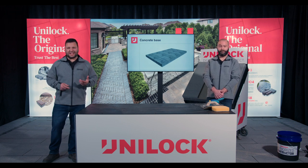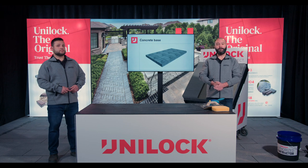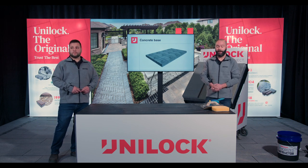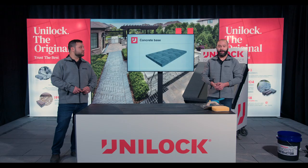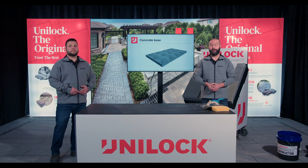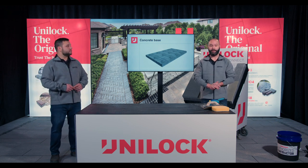If we're installing wet set on a concrete base, does that mean we need to pour a new pad, or can we work with what's already existing? Not necessarily — as long as the slab is structurally sound and not subject to frost heaving or any other type of heaving, it's good to use. A lot of guys are cladding over porches, which is totally fine. If slabs are sloped and you want a more level patio, you can use a ramping mortar. I like to use Ardex AM100 — it's a great ramping mortar that you can set a slope to, ranging from a quarter inch to one and a quarter inches thick, and you can apply it in lifts if more repair is needed.